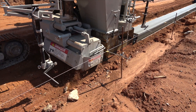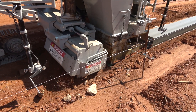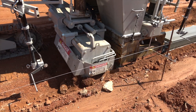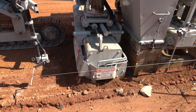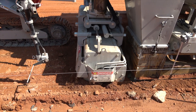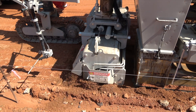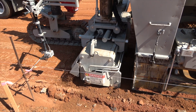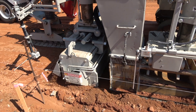Generally, they don't have a trimmer. A trimmer is an important feature for cutting the grade right in front of the mold. How many times have you arrived at a job site to find the grade dead solid perfect? Doesn't happen very often. Or if your little machine has a trimmer, it's not attached to a large heavy foundation. If you hit a rock below grade, it puts a shock load back through the machine and that's going to show up in your product. So you'll miss out on an important feature if you opt for a smaller machine.